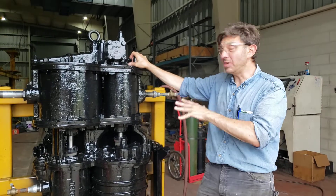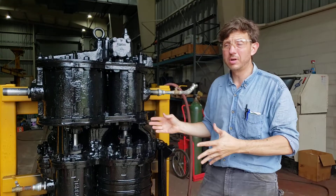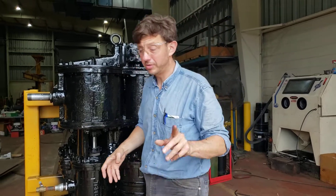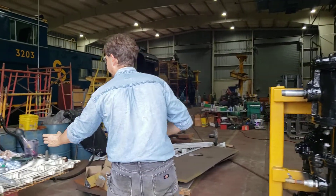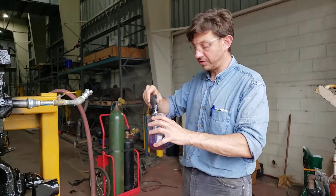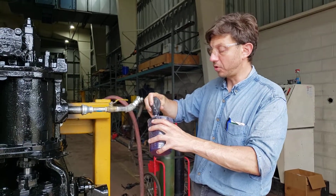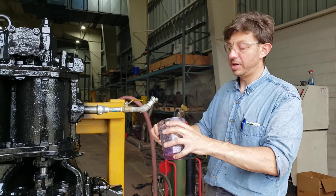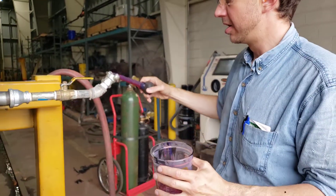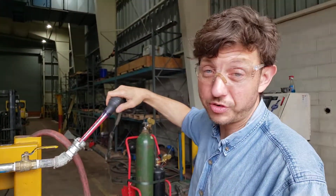So how do you do that? These were rebuilt by Bernie and set up for temporary storage — well, it's been 20 years. It's held up, but it's time to redo it. So you take a heavy oil. You can use steam cylinder oil, or in this case, this is Interlube Corporation out of Cincinnati, Ohio — 2400 Journal Guard. It's really thick stuff. Look at the string of oil — it's super, super thick. You have to properly baste your appliances or they just won't last.